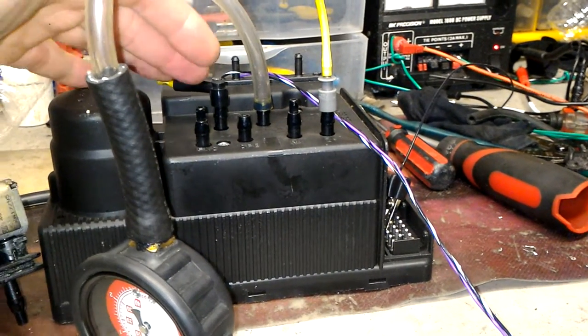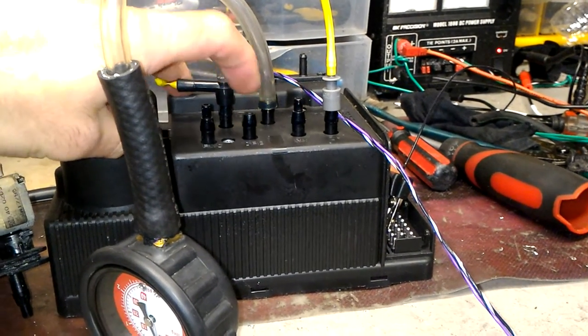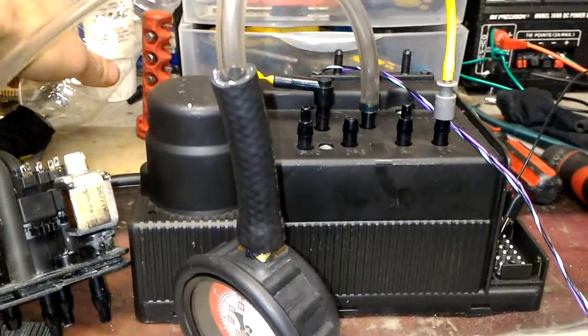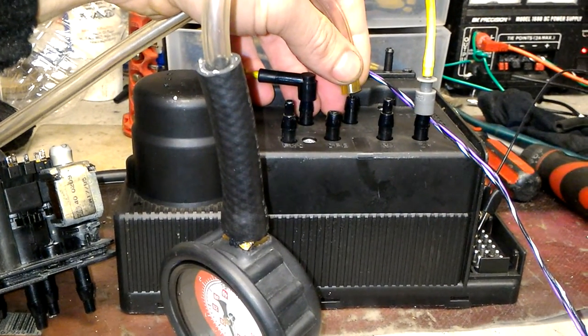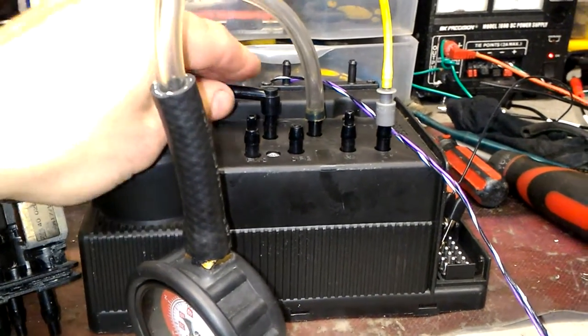The test of the pump — you see me in my other videos how I test these pumps, and I test all the ports for proper vacuum and pressure, because this is a dual action pump. For example, right now the pressure reservoir is full. I just released the pressure of the pressure reservoir — now it filled back up and it's fine.